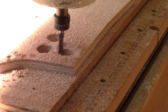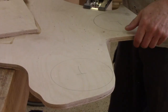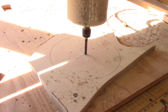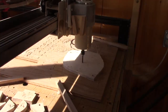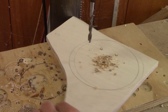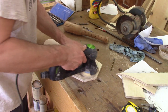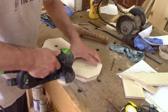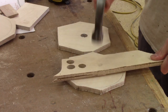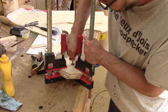First I tried to cut a 22mm hole just to see if it would work. To my great surprise, it worked like a charm. So I cut more pieces of plywood for the base of the station and make a 22mm hole in the pieces. The center layer is easier, but my pieces are a bit too big. The big blade on my bandsaw is not the best to cut plywood, so I have to sand it a bit. Then I can pound the bearing into place, and glue another wheel, using a drill bit the size of the bearing zone to remove any glue that may have seeped into it.